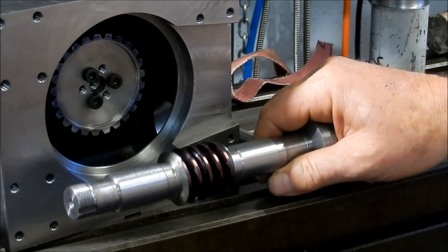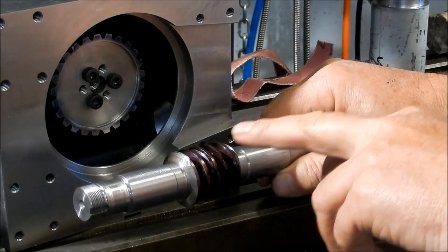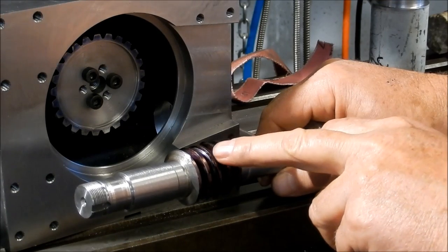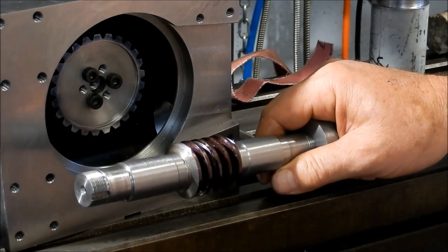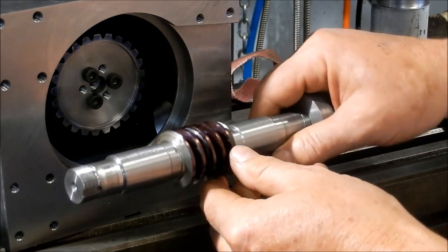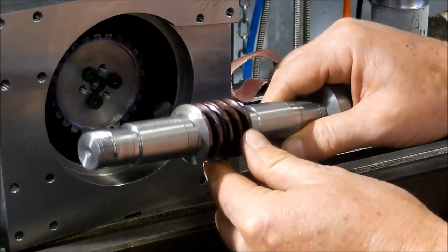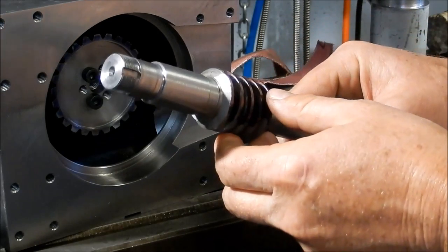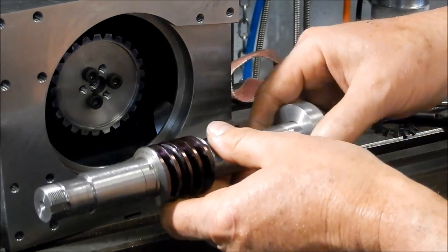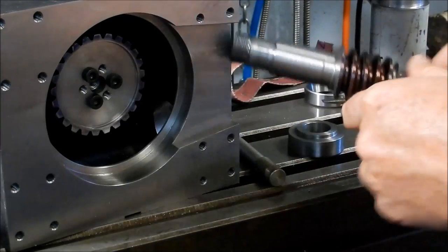So what I'm going to do is set up my lathe for a module cut. I've got a tool there already that I've done some worms with in the past, and we're just going to give that flank just the slightest little kiss, just to remove the slightest amount of material. Give us a little bit more clearance. It's not rubbing on the top or the bottom in any way, but it's just on that flank. So we're going to set that up now, give that a little lick, we'll get that right. And then we'll move on with the next operations.